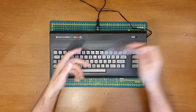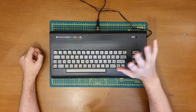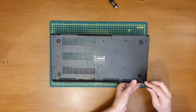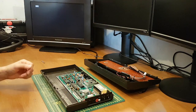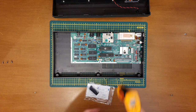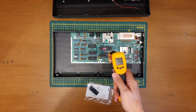And this is where the heat sink comes in, so now I've got to take it apart again. I'll see you in a bit. Back in and we'll pop the heat sink on really quick. Let's see if we can get a temperature reading off that chip already — 24 degrees. What's the ambient temperature? Let's find something else to measure — also 24 degrees. Who knew? It's about 24 degrees ambient — so we didn't even warm it up above ambient, which is nice.